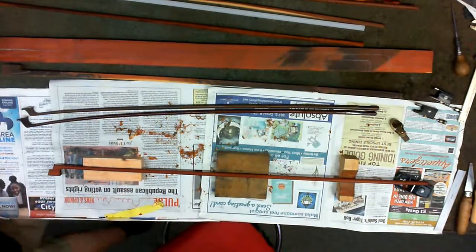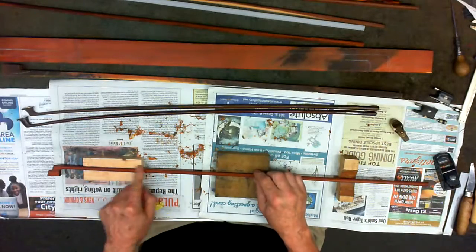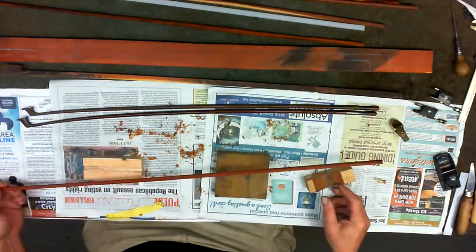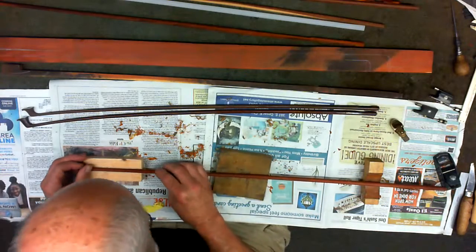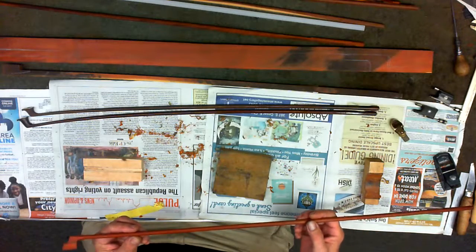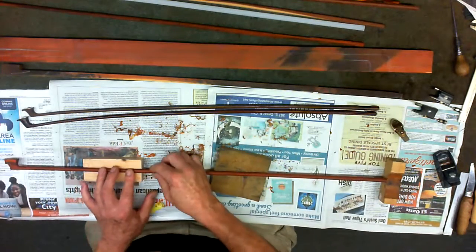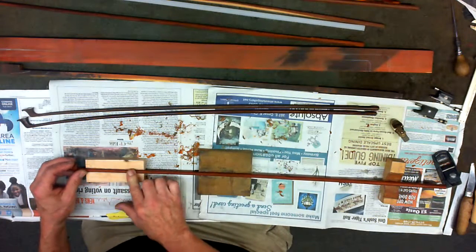You've got to make sure all your knives are nice and sharp and your glasses are nice and clean, because a lot of this is done just by sight. You work on it, you look straight down on it. Each one of these facets gets smaller as it goes down there — it looks a little bit thicker here than here. It's very delicate at this point; you have to be careful how much wood you take off. That one is definitely too thick. Each facet has to be the same width to come out evenly — that one's wider, this one's skinnier.